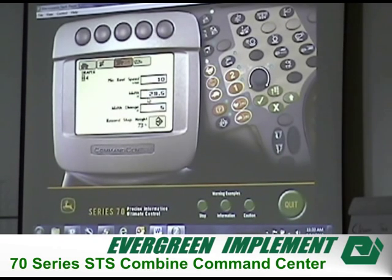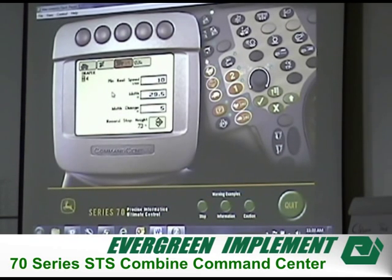Go to page three — this is where it tells us what header we have hooked up. On these newer combines, when we hook up the wiring harness, how the harnesses are made on the combine, it knows what header it is. This one has a draper header on it and it's had a draper header on it for four hours. That doesn't mean it only had one draper header — it might have had three draper headers, but altogether in its life that's how much time has been on the draper header.